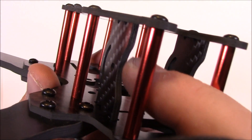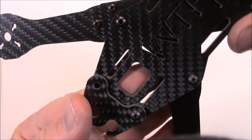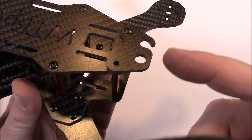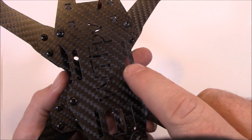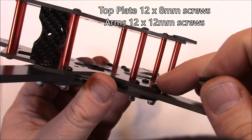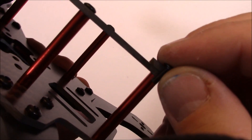These camera mounts are extremely thick for being camera mounts, which is very surprising. Back here on the back you can see it has some holes for mounting your video transmitter inside, so you can still see the screen, and it has little straps that go around it — hopefully you can use those for zip ties or whatever else you need. Back here on the back it has a hole for your antenna mount, and then if you run your power distribution board wire up, you can run it through this little hole here to run your battery wire up on top. You have battery strap holders up here as well. The only thing I noticed initially about this frame is that they give you eight little screws — the longer ones are for the arms and the shorter ones are for up top. But on this back plate, because you have this extra plate with the antenna holder and the wire holder, this little screw barely gets any threads in.